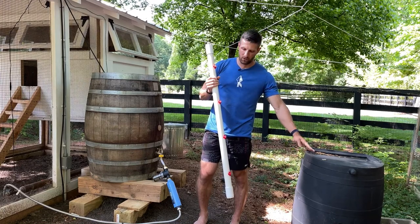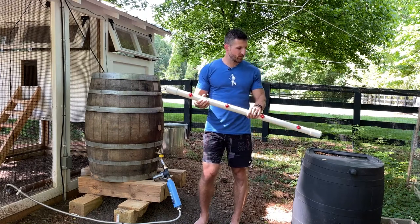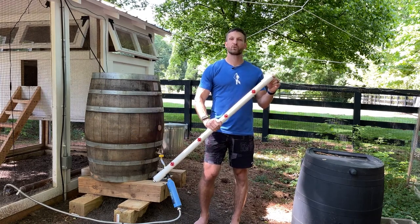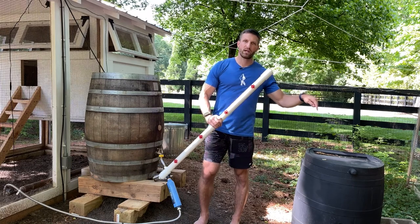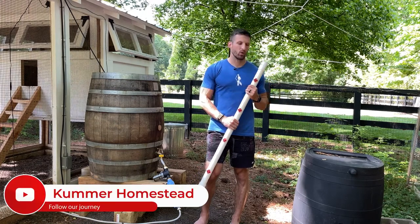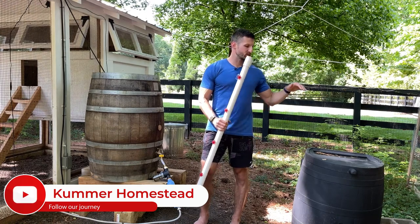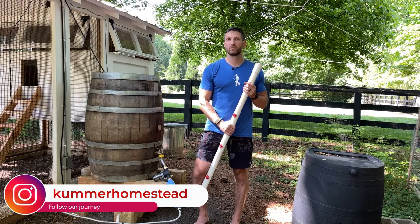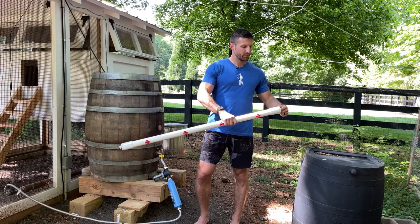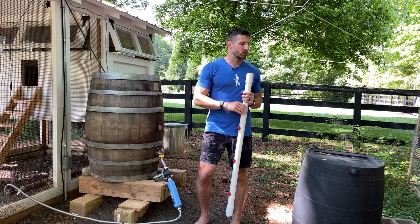You can see the two components of this watering system here. One is a plastic rain barrel and the other one is a PVC pipe with nipples on it. The whole system is gravity fed, so you fill in the water, connect the hose to one side of the pipe and the return to the other side. There was actually a recirculation pump in between, and it also came with a bucket heater. So the whole system meant we never had to refill the water because rain would refill it, and it would also prevent the water from freezing because the bucket heater would kick in once temperatures reached 35 degrees Fahrenheit. The recirculation pump would also kick in when temperatures were low, so the water could never freeze.